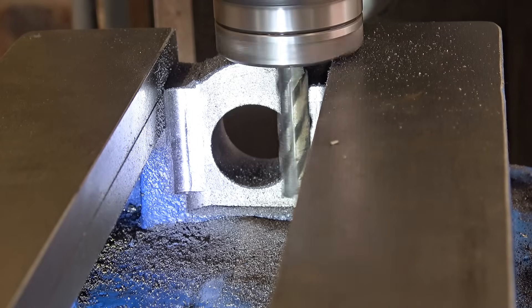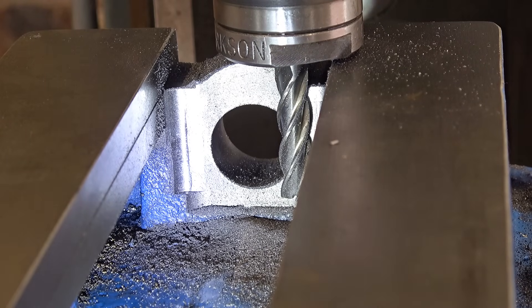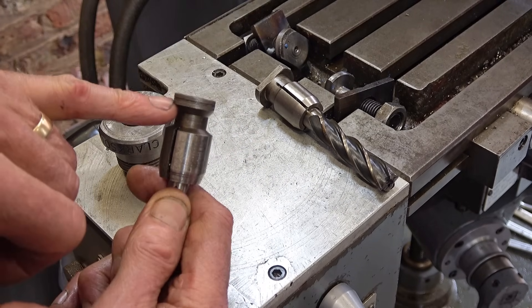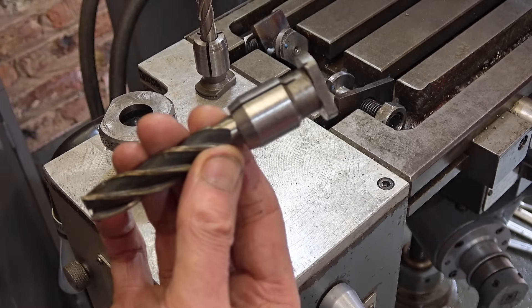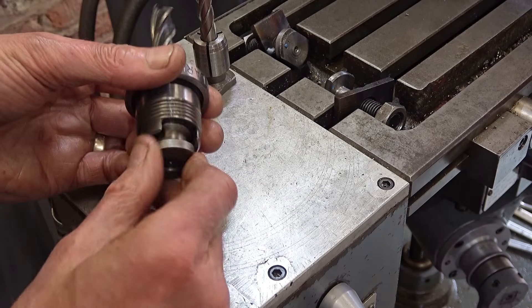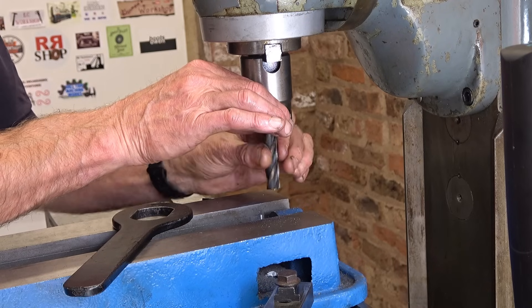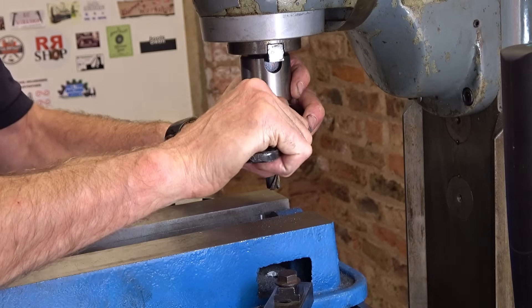Looks all right. Now I'll go for the longer cutter — I may do the whole face, don't know yet. This Clarkson tooling is great. The cutter that came out was a 10mm. Now this has got a mark — a notch — that means it's a metric collet. This is a 5/16 long which I'm going to fit, and that one's not got the mark so I know it's an imperial collet. Back the cutter off, turn the big nut till it touches, move it back a fraction, turn the cutter till it stops, then lock it. Just a little tap — that should be enough.